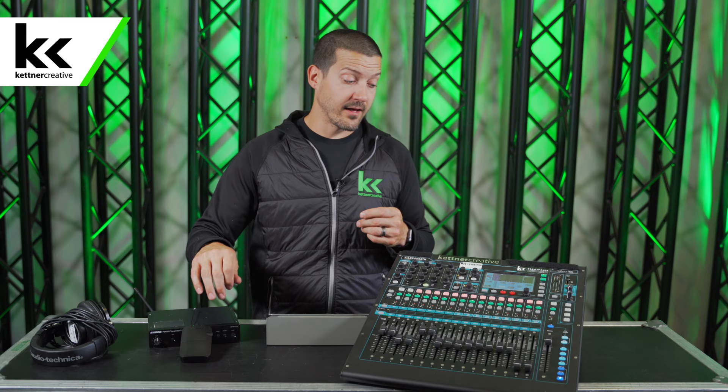Another huge advantage to going with a digital console is the safety perspective. With a digital console, you can put in a hard limiter to make sure you're not sending too much signal to any one headphone amp. What I like to do as a sound engineer is plug in the headphones myself, set up the limiter, then unplug my headphones and give the body pack to the artist. When you hand over the body pack, make sure the volume is all the way down on the body pack itself — the last thing you want is sending a fully loaded body pack to the artist where they plug in and get shocked with loud noise right away.